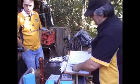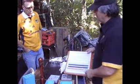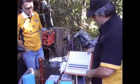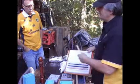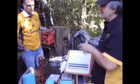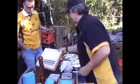Sometimes I spray the tube with an acrylic, because it helps fill the gaps and you get less trouble with the air bubbles. But I'll always paint these first with resin with a paintbrush before I cast them, and that way I know there's already resin in those little grooves, the gaps. Go through that later on.